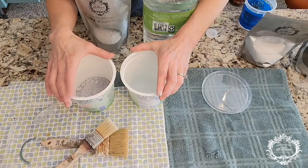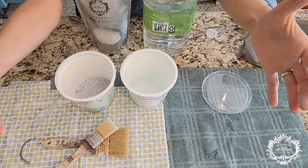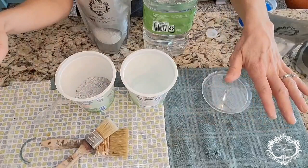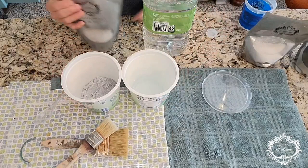Also, the recommendation is to apply milk paint on a flat horizontal surface rather than up and down on a side, because it can tend to run and you get drips — it's not very attractive. Take your piece — whether it's the exterior of your dresser or your drawers — set them on the floor and apply your products to the flat horizontal surface. We're mixing this right now; I have the Scandinavian Gray milk paint, which comes in powder form.